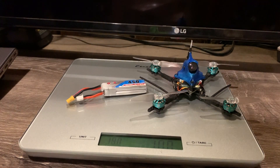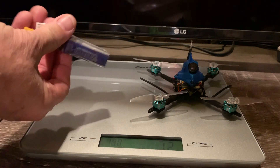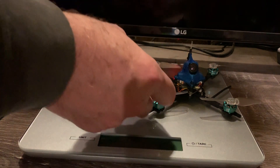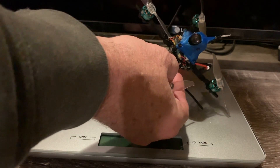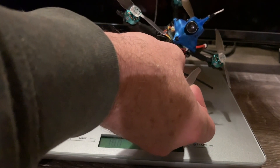I was also flying with 350mAh 3S batteries, which are equivalent weight, also coming in at about 100 grams. With Betaflight 4.1 loaded on it and slight adjustments to the default PIDs, this quad really flies straight like a laser — as Kabob describes in his video. I think it flies even better than the GTB 339, which is an excellent craft that I also thoroughly enjoy flying. I do prefer the X-style frame design over the GTB 339 cube frame. The thick arms should hold up well in a crash.